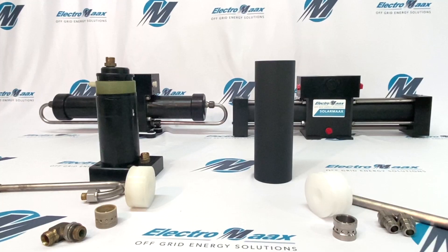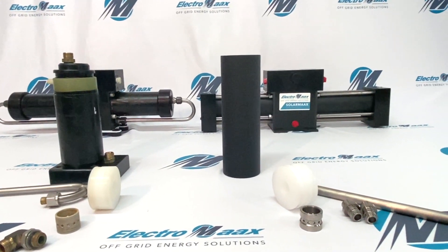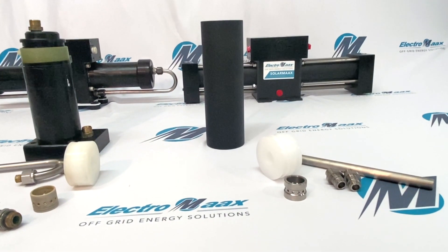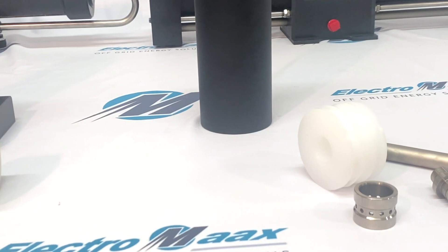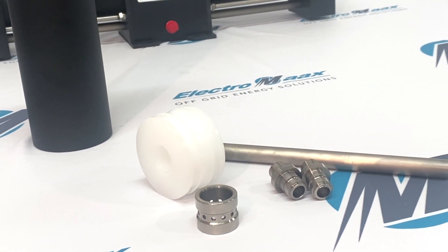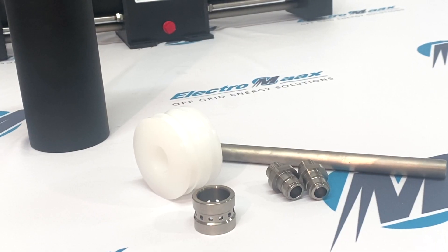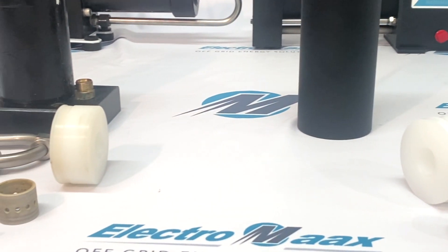The physical differences of the two pumps: the original was 27 inches long, ours is 25.5 inches. Our version is slightly shorter, but exactly the same depth. A critical enhancement to the system is the original cylinder was only 7.5 inches long. We've increased that to 11 inches, which smooths out the stroke and quiets the pump significantly.